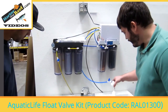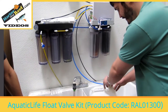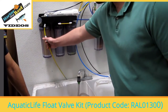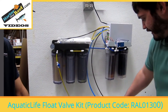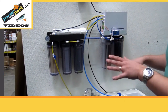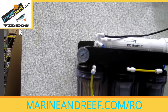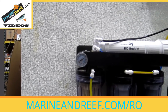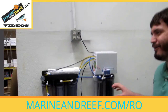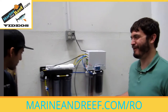So let's go ahead and make some water. We have our float valve mounted in this cap, I'm going to push it in, screw down the cap, and we have a series of valves here. We're going to turn on the water supply and then we're going to turn on water coming out here — and we're making water. Now that water is going, we can address the pressure gauge. What the pressure gauge measures is the water pressure going into the RO membrane.